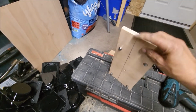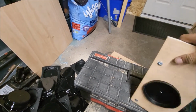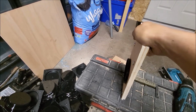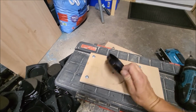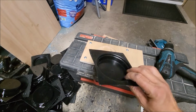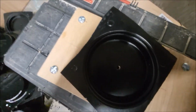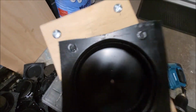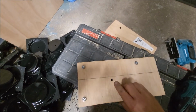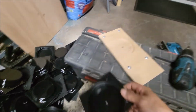So I'm going to make a little recess in this for a handle so I can hold it. I can hold it like that and run a hacksaw down that edge and cut that out. And that's going to be to the right depth then. In reality, it'll look like this. Sit that in there. I've put holes through each one, so I'll actually bolt it in place through there, put a nut on the back here. So that's what I'll do, and that'll cut all them down.